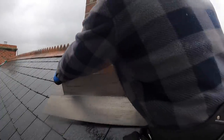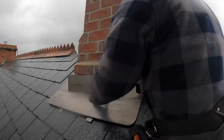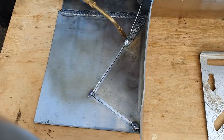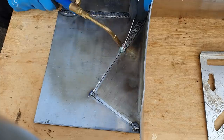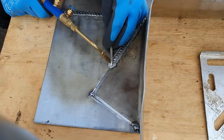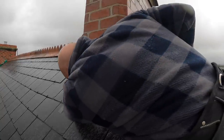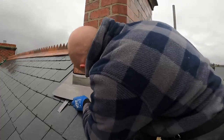While it is possible to boss an apron out of one piece of lead, it's far easier to get one welded. Lewis, who did our bay window at the front, offered to make these up — they're made to suit the width of the chimney. You can order them online as well, but otherwise find a local lead worker and they'll make one up to suit. It's super satisfying to watch back on video, and later on Lewis came back to weld up the edges of our flashings.